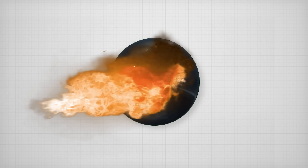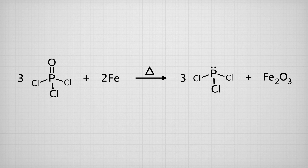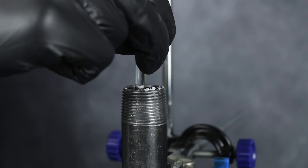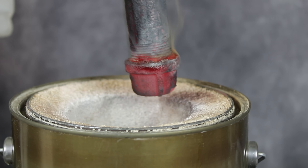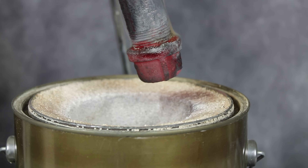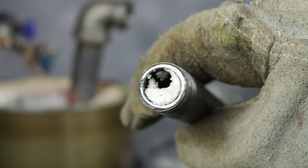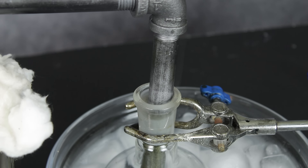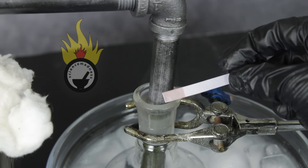Steel is probably one of the best materials for a reactor like this, given its availability and extreme temperature tolerance, but it can be problematic if you aren't careful. As I mentioned before, iron can reduce phosphoryl chloride to phosphorus trichloride at high temperatures. This process not only introduces some trichloride contamination, but it also leads to corrosion of the steel, which may be catastrophic under certain conditions — for example, if you overfill the reactor, like I did here. It might be hard to tell, but the steel is actually burning here. That reddish smoke is iron oxide. The end cap was screwed on as tight as I could get it, but evidently the pressure formed by the clog was high enough to force phosphoryl chloride around the pipe threads, burning them away in the process. This was the last time I ever used that retort. On the bright side, the acidic vapors and characteristic smell created during the distillation did confirm that this was a viable method for producing phosphoryl chloride. You win this round, Science Madness.